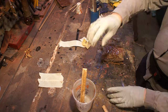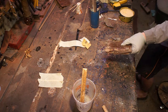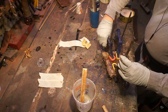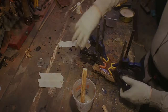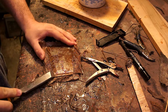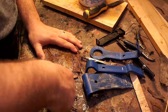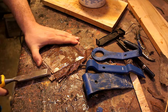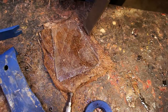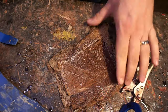Off camera, to make sure the epoxy didn't stick to the glass, I used some paste wax — basically the same thing you'd use on a car — to make it slippery enough. That was the plan anyway, but man, that glass was a bear to get off. I tried about everything and was really trying not to break it. Eventually I stuck a chisel next to it and hammered straight down, which flexed it just enough to get it off, but I did end up breaking a little bit of glass.